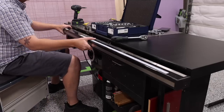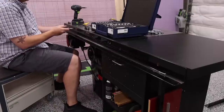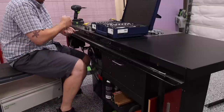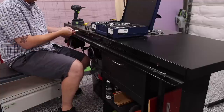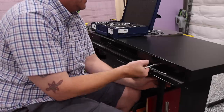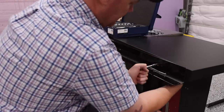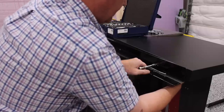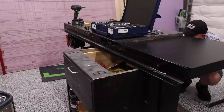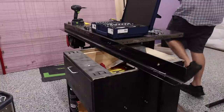To start the install of this fence, you obviously have to first remove the front and rear rails. This is a pretty straightforward process as they are just bolted on with a combination of screws and bolts. When removing the second rail, pay special attention to the existing extension table to ensure that it doesn't fall off. There is one small set screw that holds this extension table in on the SawStop from the bottom, but if it falls you do run the risk of bending that screw.